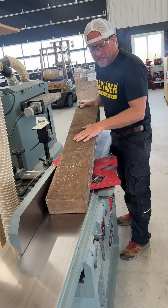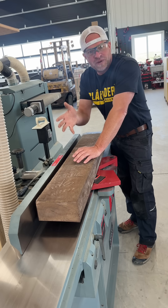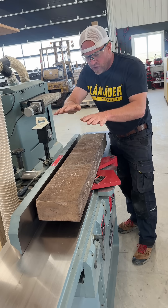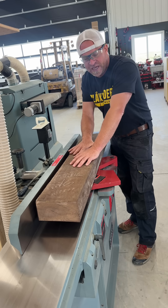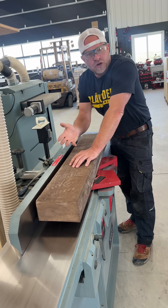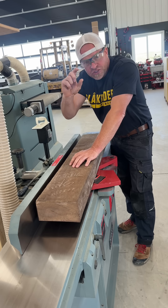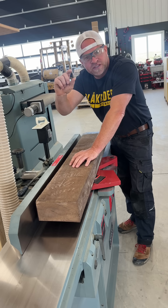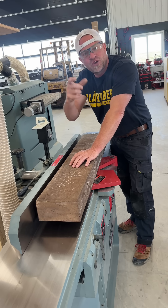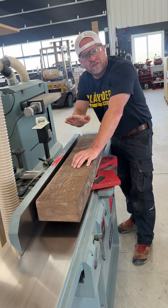This is a chunk of seven by four black walnut, all rough. The first step for any wood that becomes furniture is for the tree to get cut down and milled into rough dimensions. That rough lumber goes to a kiln or sits outside to dry, and while drying the wood moves, twists, bends, and tries to find equilibrium. This is why two-by-fours aren't actually two by four in the store — they shrink during drying and get planed smooth, leaving you with one and a half by three and a half. So the jointer's first job is to get everything flat again.